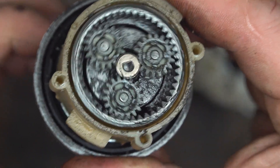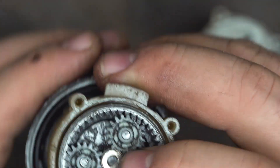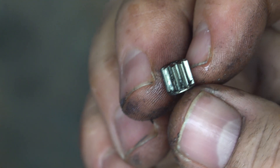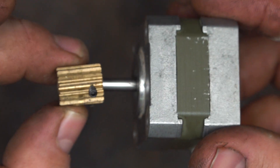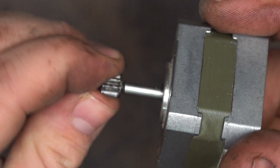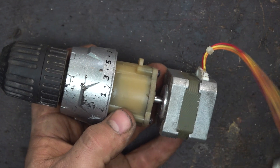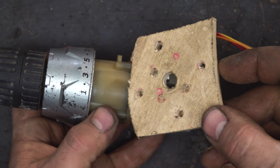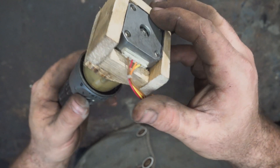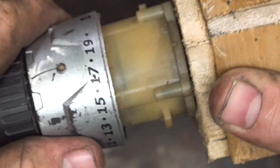Inside the plastic there is a planetary gear system, which converts the very high RPM from the motor into very small RPM for the cordless drill chuck. I can take the original small gear inside the planetary gear system and swap it with a bigger one from the stepper motor. I did this using a grinder, restricting the shaft and swapping the gears — all the parts fit together perfectly. I add a wooden block base with precise holes and some epoxy glue to make a little box around the stepper motor.